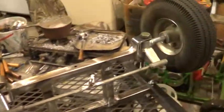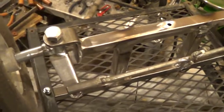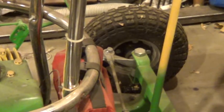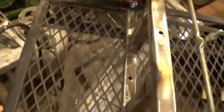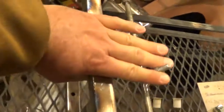The front end is built just like a go-kart. I had extra pieces left over from when I built the motorized bar stools — and those have the same spindles on them. There's one of the spindles, and it comes over and there's a steering knuckle in the center, then it comes over to the other side. I didn't need to have a steering shaft that comes up with a steering wheel on it since it's not going to be a motorized bar stool and I'm not putting a motor on this thing yet. What I'm going to do is put some flat strap on here that comes out, bends back up, and hits this pivot point here and continues on to this point — and then it'll just steer like so. I'll have a handle hooked on to the flat strap that will run out the front, and as I'm dragging it around it'll just pivot on that pivot point there.